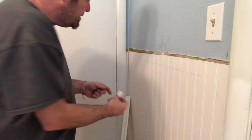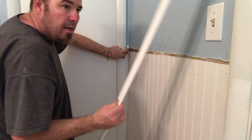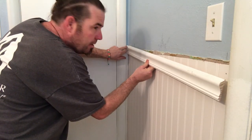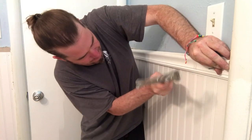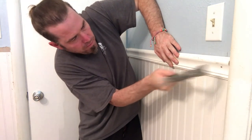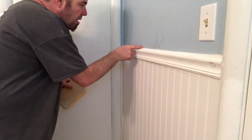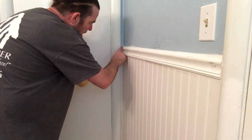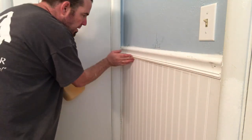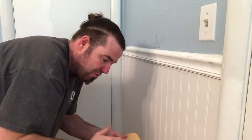When you're doing chair rail, we're going to cut it to fit — it's just going to cap over the ugly line. With something like this we're going to have to put in a little piece; otherwise it's going to look funny if it's naked, and then the full piece is going to fit over top of it. Make it level. You can caulk the corner and the door jamb. Something little like that I'm not going to shoot with a nail gun because shooting is probably going to break it. Get off all the excess caulk, then take the excess off with your finger. Use a clean sponge to wipe it down — it'll give it a nice smooth finish that doesn't look like you used your fingers.